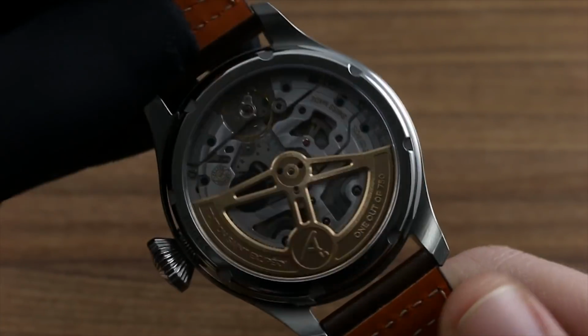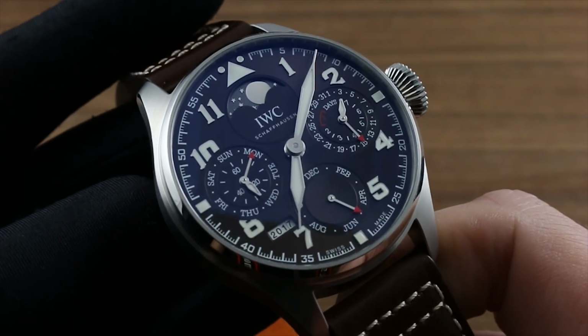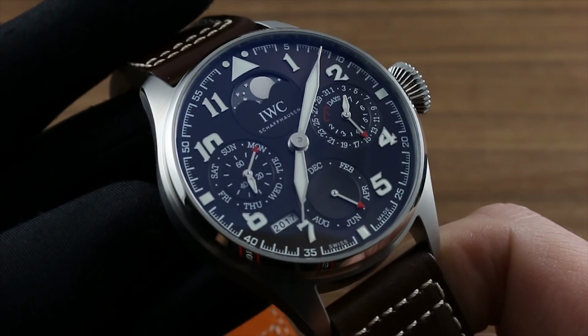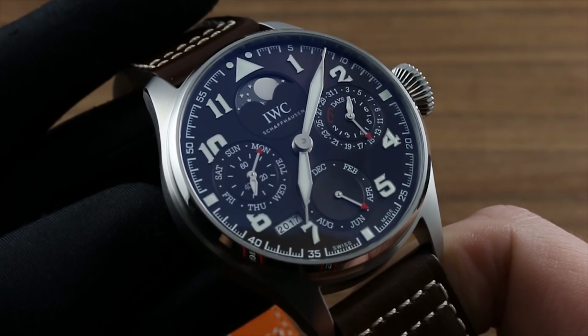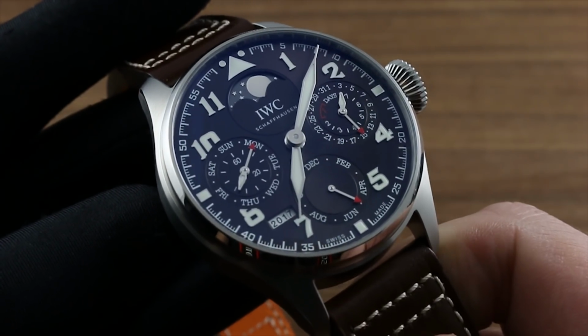Concussion, however, cannot be remediated so quickly. Minimally, concussive activity can cause timing deviation. Maximally, a shock can cause enough damage to stop the movement. Therefore, ensure the watch is disused during firearms marksmanship, the riding of ATVs or mountain bikes, batting, tennis, or golf.